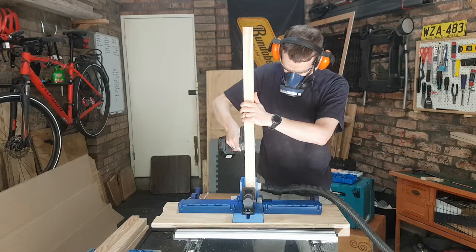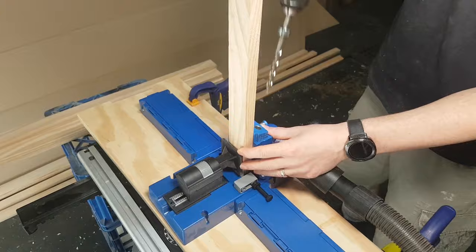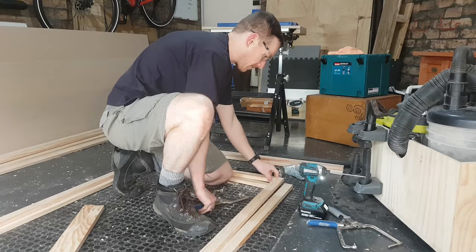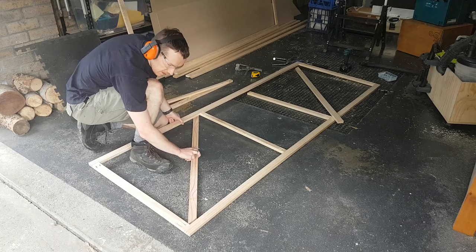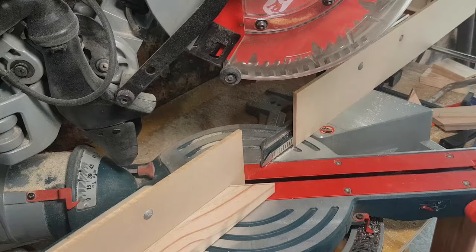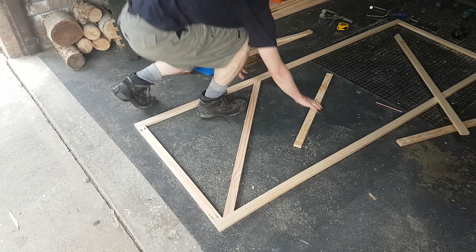Because I don't want any external screws showing, I've decided to pocket hole everything with the K5 Kreg jig — fairly standard procedure. All the holes go into the rails. One of my biggest challenges for this project was that these doors are 2.3 metres tall and I don't have a bench big enough to hold them, so I had to set up everything on the floor. This is how I like to do my Kreg jigging with the double clamps in that situation. For some strength and stability, we're cutting some mitres — actually using the mitre saw for mitres — using the trick of pushing the wood hard against the blade, raising the blade, then coming back down to nip off a bit.